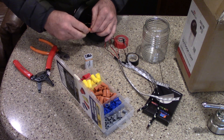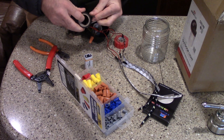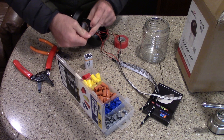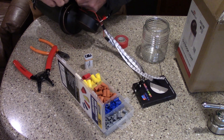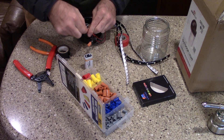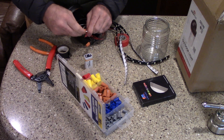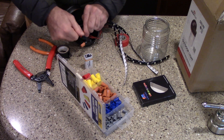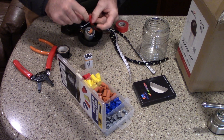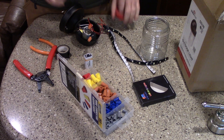I take the orange wire nut — black to black — twist them together, now the wire nut. For outside lights, listen for a click from the wire nut — that means it's tight enough. Now I get some electrical tape and go around this wire nut one more time. It helps keep moisture out and also locks the wire nut down in case there's any vibration. Now red to red — we made this a red wire with the red tape. If anybody ever has to go behind you, you did them a nice favor by letting them know you changed the color of that wire.